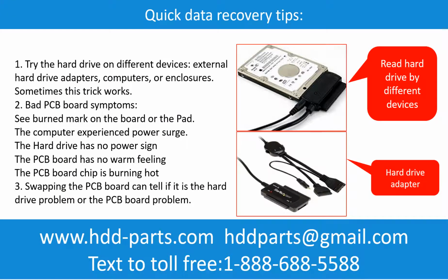There are some simple ways to recover data from a hard drive. One of them is try to read the hard drive by different devices, like different external hard drive adapters, computers, or enclosures. Because different devices use different ways to read a hard drive, sometimes this trick works. Another way is swapping the hardware PCB board. Swapping the hardware PCB board can fix the problem caused by the PCB board. There is a cost in swapping the PCB board, but it is way cheaper than sending the hard drive to a data recovery firm.